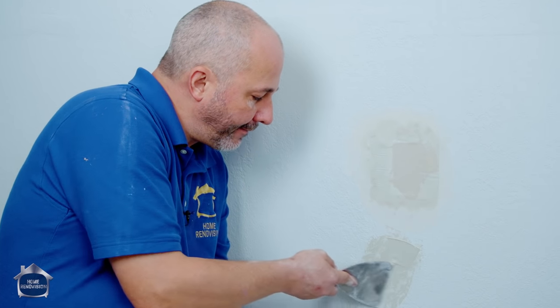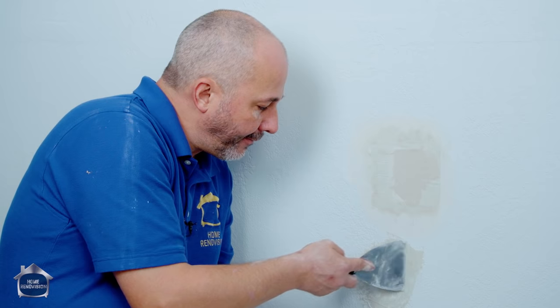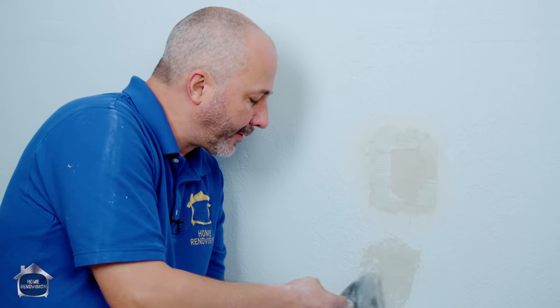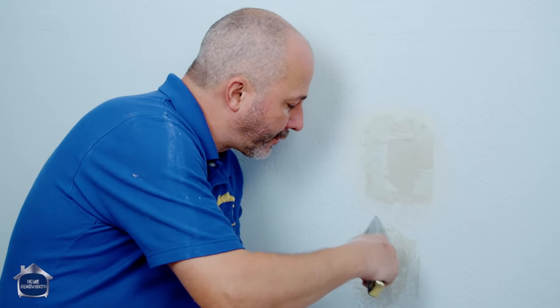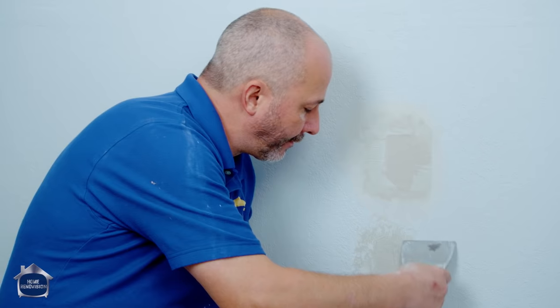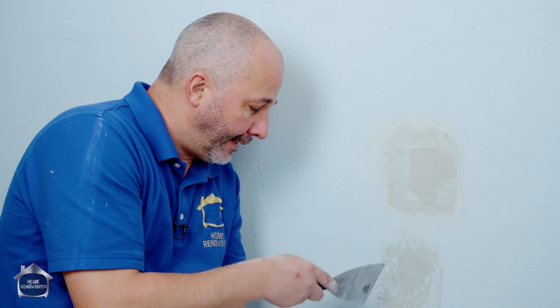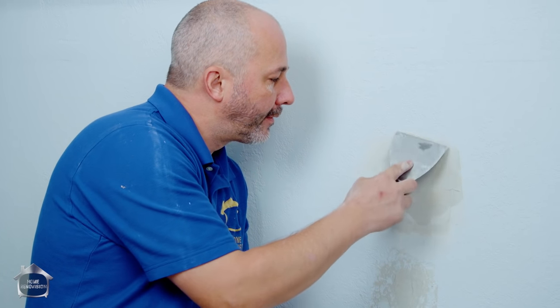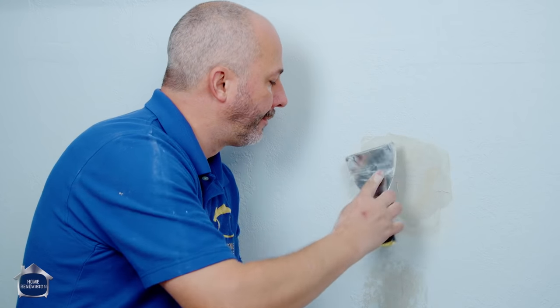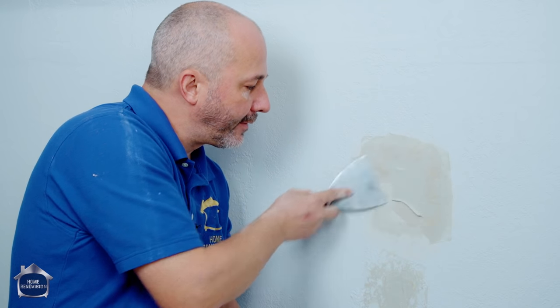The secret when doing this is to leave a little bit extra right where the actual hole was - 45 doesn't shrink much, but if you have a lot of filler it will shrink a little bit. Clean it up and come around the outside of the edge, scraping it well so you're not leaving extra mud in the texture. You don't want to flatten all of this out. Up here we go thinner, working around to where the sanded area is and pulling toward the middle to create a smooth surface to add texture to.